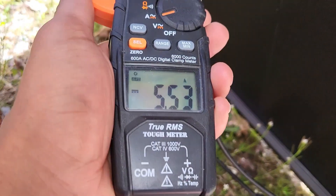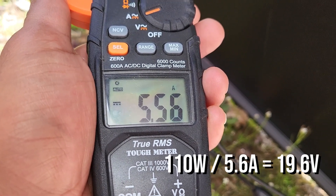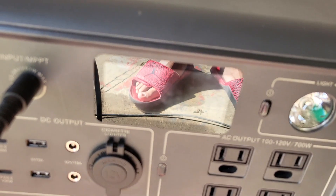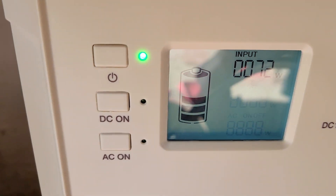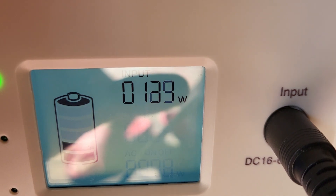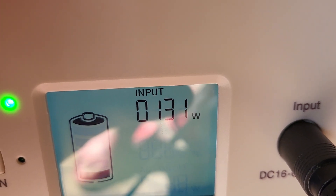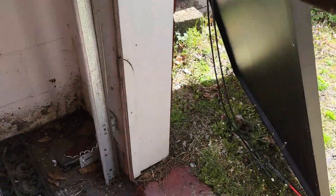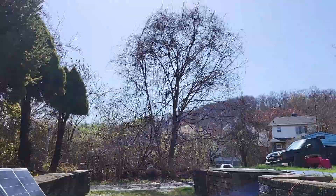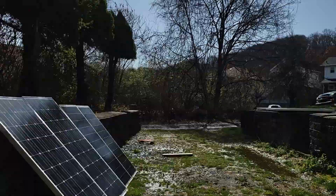Popping it on and that's getting less amps — I don't know why it would be getting less amps. So 5.5 amps. Let's switch it quickly. This one's still getting 112. See what this one gets — 131, 133. So about the same, and I'm sure that amp output is gonna be a bit higher. Back to what it was before — yeah, almost seven. These are the sun conditions: it's a pretty bright, sunny day, might be a little haze around the sun. But that's what we're getting from this Arska.